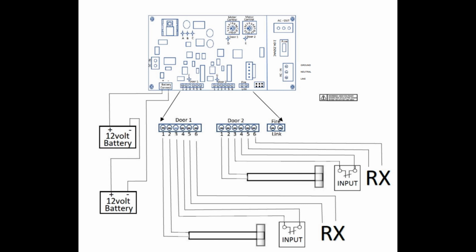So it would be more than double the amount of amperage that it should be. At the end of the day, it could easily be explained that you don't have control over your potentiometers because you've got a lot more amperage going through there, which means something else is wrong in the voltage formula of E equals I times R. Voltage equals amperage times resistance. So there's something else wrong.